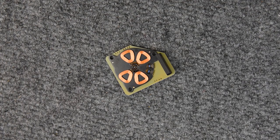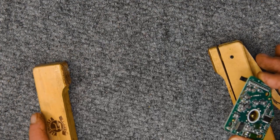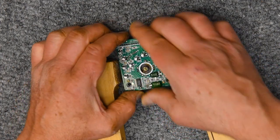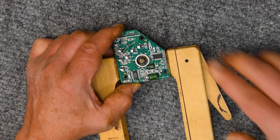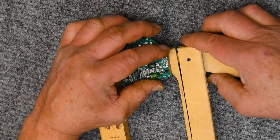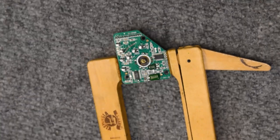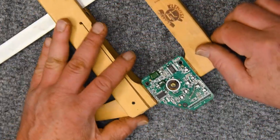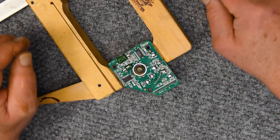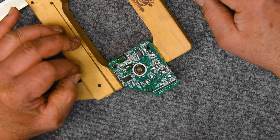And the other thing I'd like to do on the recapping is to show three different ways to remove these old SMD caps. One of the things that we run into on these is that there's a good possibility the caps have leaked and the electrolyte has possibly compromised the trace. At very minimum, it's oxidized the old lead-free solder, and so it makes it more difficult to remove. So I'm going to show three different ways to do that, and I hope that might help somebody out.